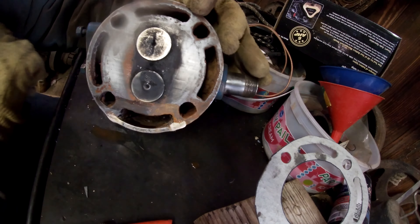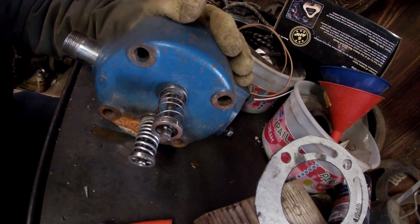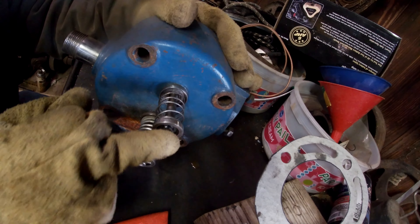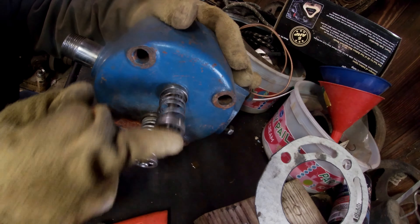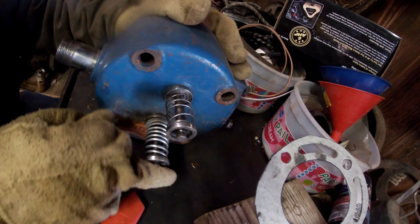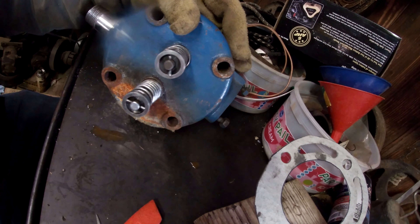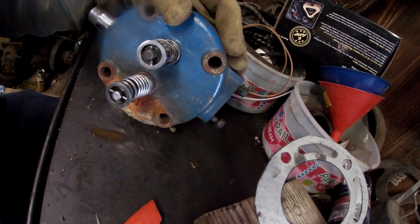If you're not sure how these work, it's basically just like a regular engine. You've got your intake valve up here and your exhaust valve down here. The difference people don't always understand is there's no rocker arm on your intake valve — as the piston goes back, it just sucks in a breath of fuel. Your rocker arm is only on your exhaust valve, and it just keeps pushing and opens that up. They're really not as confusing as they seem.